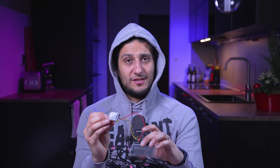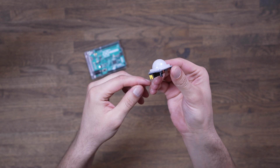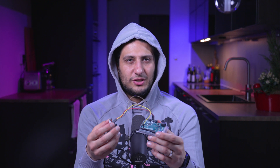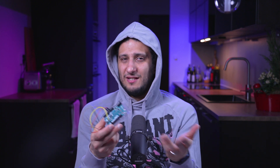So, how do we break the screensaver when someone gets in front of the mirror? Well, the solution is also kind of easy. I used a PIR sensor — or as known to most, a motion sensor. This is a very easy-to-use circuit. You give it a low-voltage feed, and it will output a small signal whenever someone passes by. I have connected this to an Arduino Leonardo, and you have probably heard of Arduino boards. In short, they are small controller boards that you can use to control lights, motors, actuators, servos, you name it. And programming them is fairly easy if you have some type of programming background, or even if you know JavaScript, you could probably program it pretty easily.